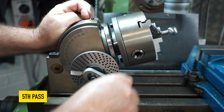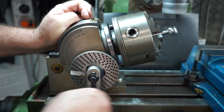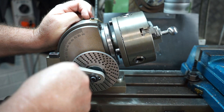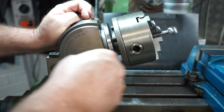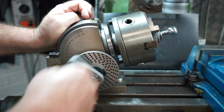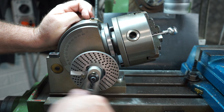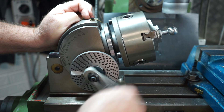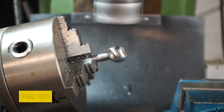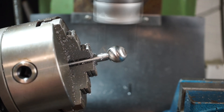This is normal speed now — you can see how we get the job done. It is slow going, as there are 40 turns to one revolution of that dividing head. This is the final pass, and I've got the milling machine at high speed here.